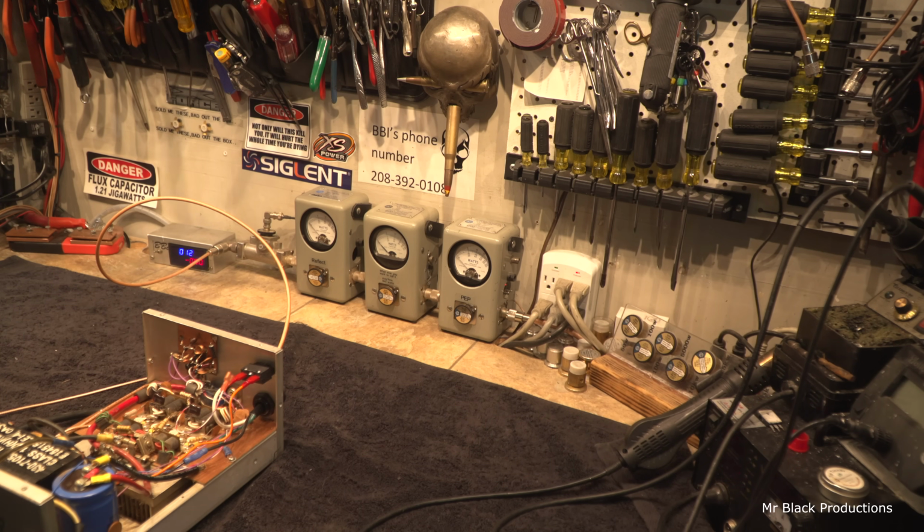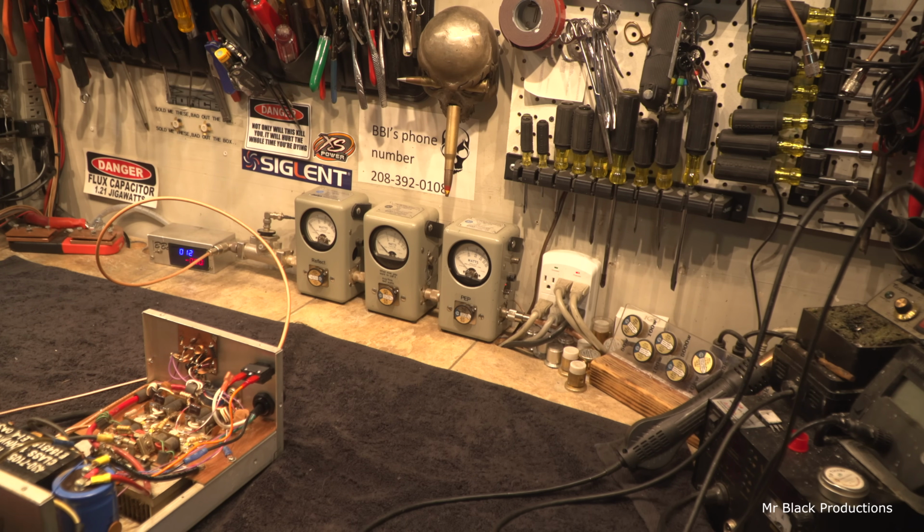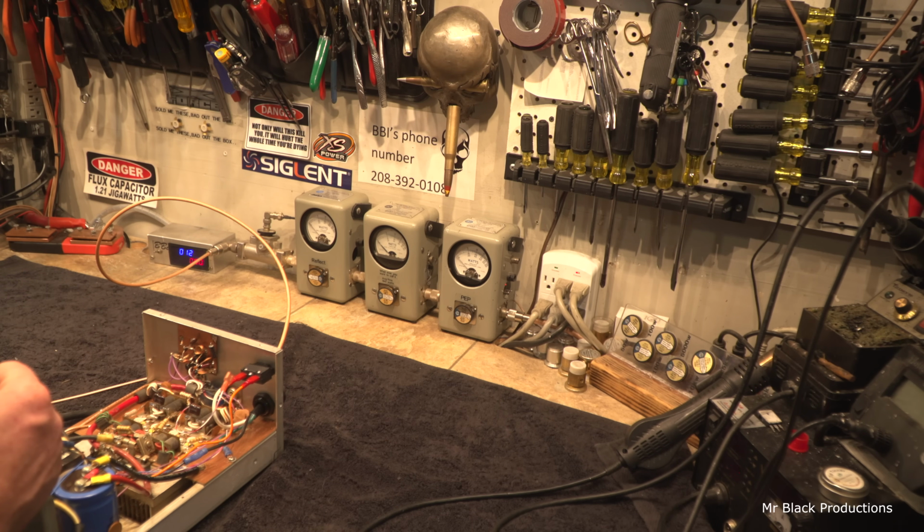This thing's working perfectly. All the transistors are lighting up and heating evenly. None of our output capacitors are wobbling around bad. Our input voltage divider that's here is not heating up. Our balance resistor on the output is not heating up. Relay's clicking. Amp is off in the OFF position, right?